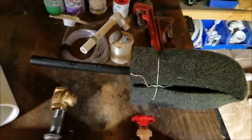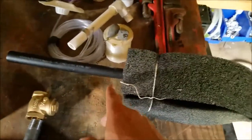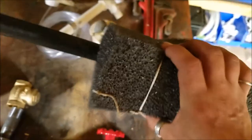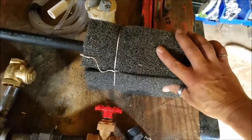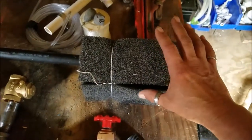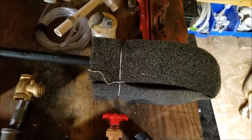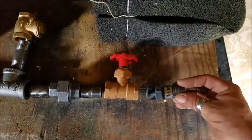We're going to start at the water end. In the water I have a poly pipe with an open end, and I use fiber foam wrapped around the pipe as a filter screen. It blocks debris and garbage — you still get some particles, but it reduces your clean-out from three or four times a year down to once a year.